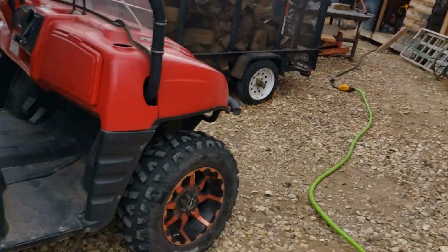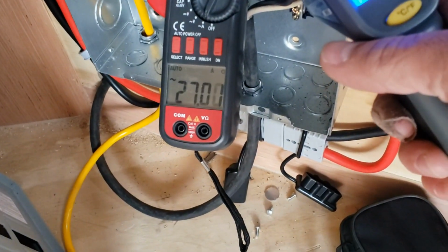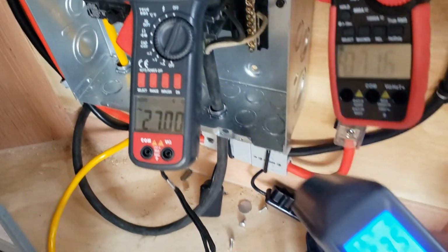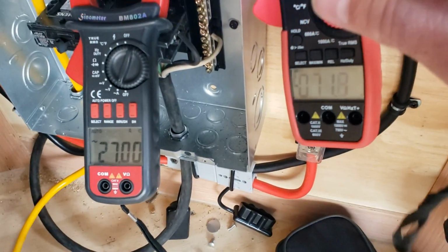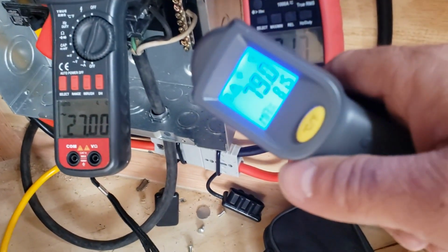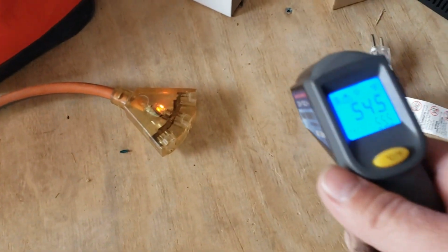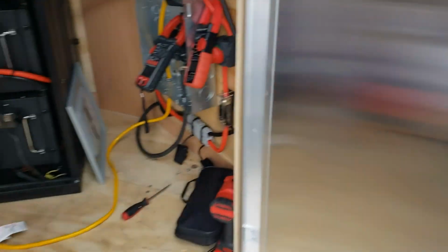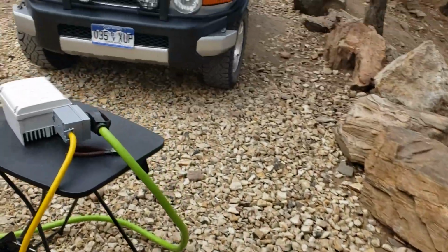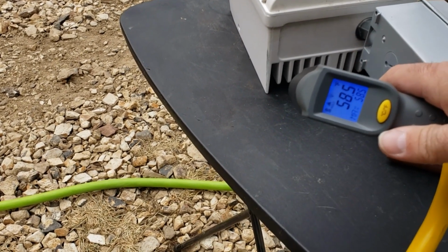So the water, we don't actually have a pressure tank out of the well. What happens is the water pumps to the cistern right here. It's a 1200 gallon cistern. And that takes 220 volts, right? And for the solar system, we have a 120 volt pump that feeds off the cistern to the regular pressure tank like you'd have at a normal house with a well that feeds the house. So we started at 550 gallons and we are almost to 700. We would normally run a generator to do this, once, twice a week, fill this up.